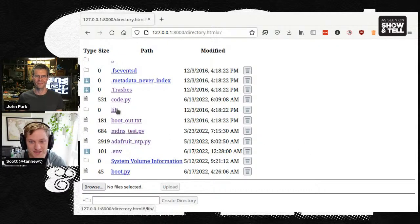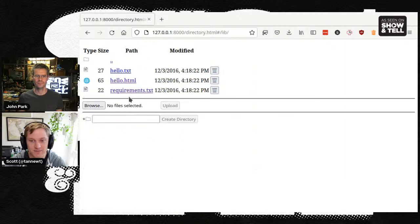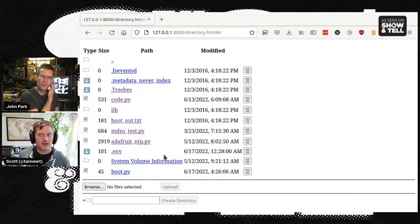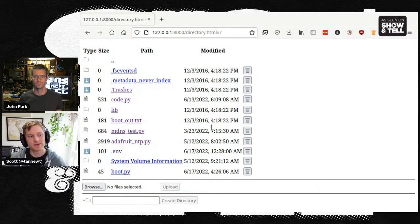But it basically works. So you can click in and see what's in the live folder here. And it's actually not doing a separate request, so it's a bit snappier than otherwise. And for clarity, this is a microcontroller running CircuitPython that is connected via Wi-Fi right now, or is this Bluetooth? It's correct, it's Wi-Fi. The HTML page itself here is actually served by my computer, but then it's doing behind the scenes requests out to the ESP that's connected over Wi-Fi.